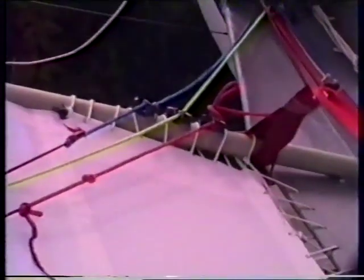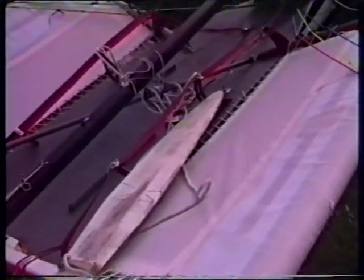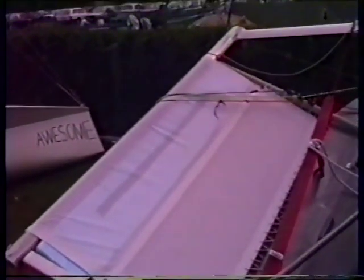The system is very stiff and very light. He's also got a very small aluminium bar which goes across to support the wing cover, trampolines and the cleats, stopping just at the centre side of the boat. The back beam is a section of foam and carbon fibre made up into a box section and run across the entire boat. It's the size of his centreboard — extremely small, not much bigger than a normal sailboard foil. He can rake it back in the case so that when he rakes his mast back he can rake the board back at quite an angle. Boats these days are starting to put foam in the wing covers and Clive's done that quite cleverly so you don't even notice it, but it's just enough to save him when he gets into difficulty.